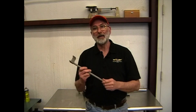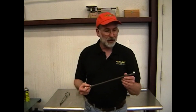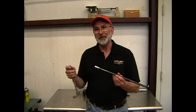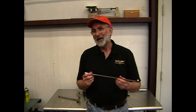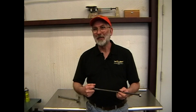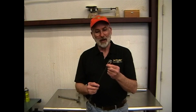The second tool is the cylinder base nut wrench. Interestingly enough, this one also came with a loop from the factory. They put a loop on it and then told us they wanted us to torque the cylinder bases to 300 inch-pounds. I'm not exactly sure how that works, because what is 300 inch-pounds to my elbow may not be 300 inch-pounds to your elbow. So in order to make this less subjective, we cut the loop off and weld a socket on the end.